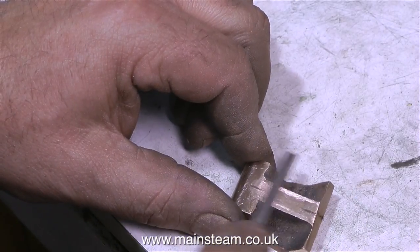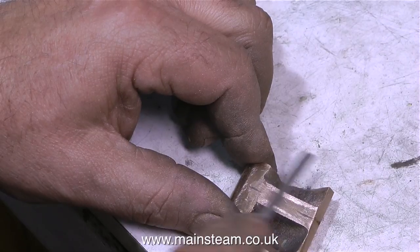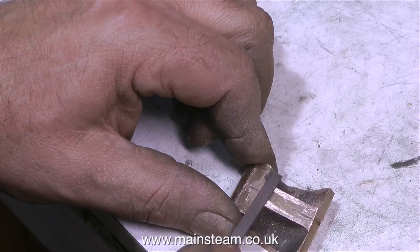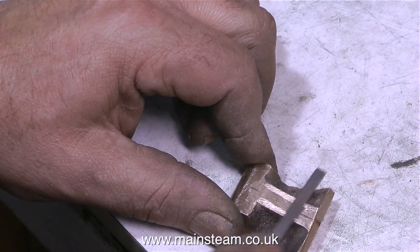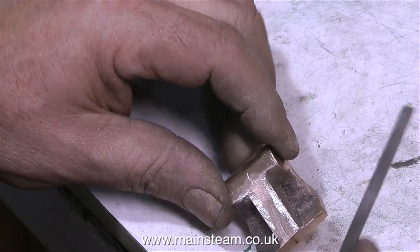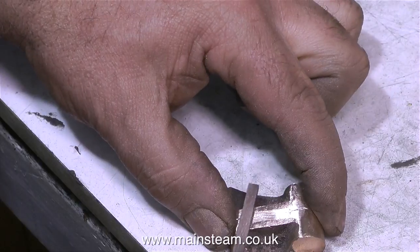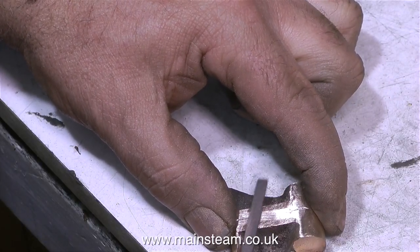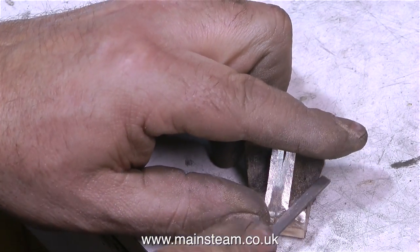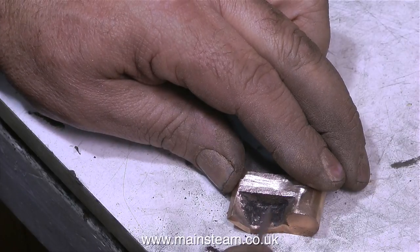I could leave it like this and it would look quite rough, but the engine would still work. And I see many examples of workmanship like that. But this is where patience really comes into its own — it's a case of filing and sanding, and filing and sanding again. I'm not going to do it all by hand though; my lifespan's not long enough. Initially I'm just using a needle file to roughly clean the part. And I do notice quite a lot of casting sand in the inside areas of the casting, which needs to just be scraped away.